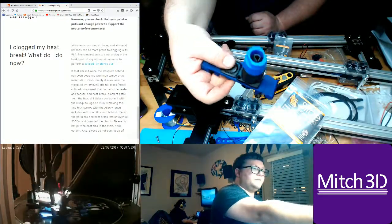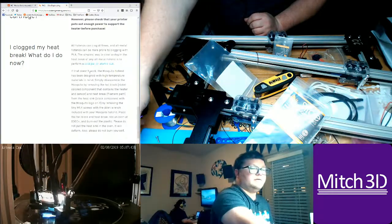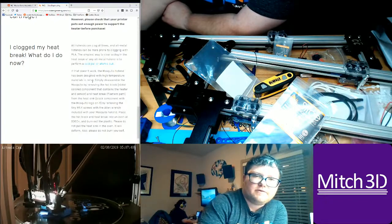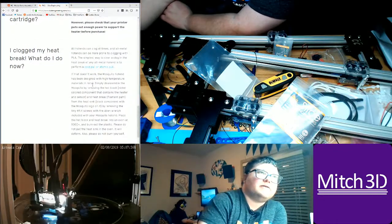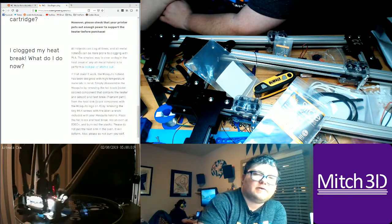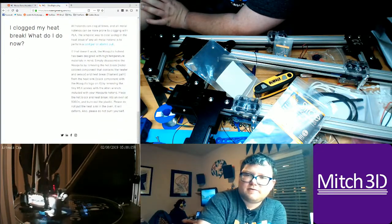This is one of them. It's a heavy-duty power connector. I'm also going to add a fuse, probably somewhere around 6 to 8 amps, so it doesn't draw too much. But really, 50 watts at 12 volts is less than like 4-ish amps.